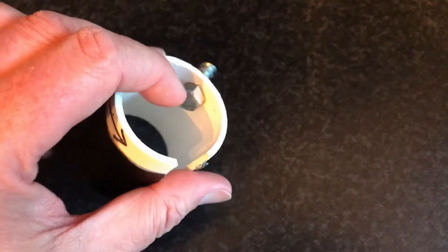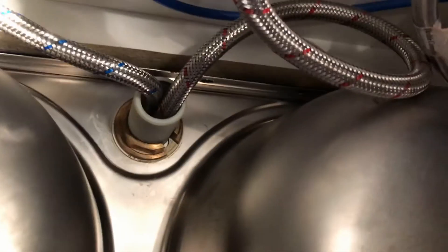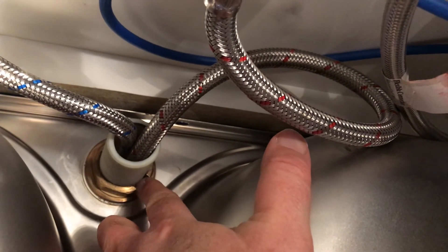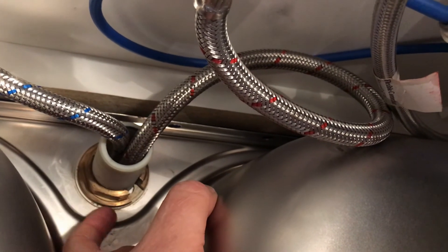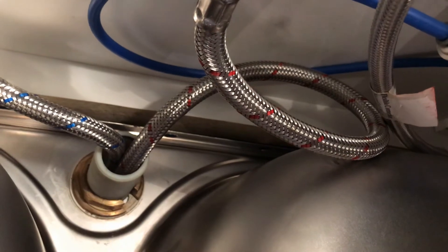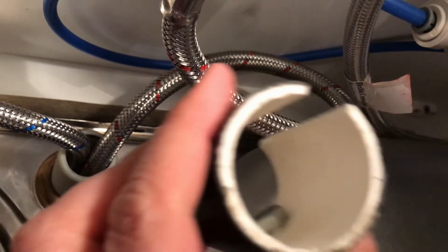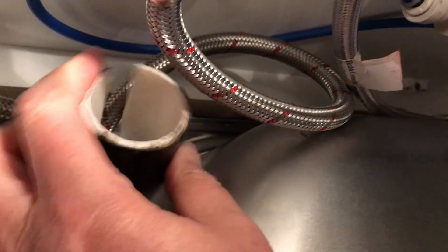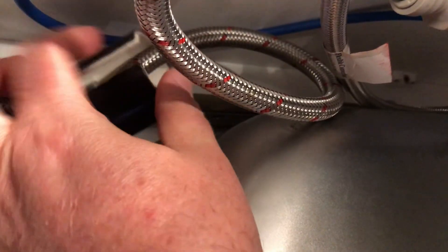So let me show you. Here's a piece of pipe — I screw through the side and that catches into the slot that's in the actual nut, and it fits over the top of the nut. Looking at the sink from underneath, the nut is up against the underside of the sink and there are some hoses poking down. The slot in my piece of pipe lets me slide it over those hoses so I can reach up into the nut area and turn it.